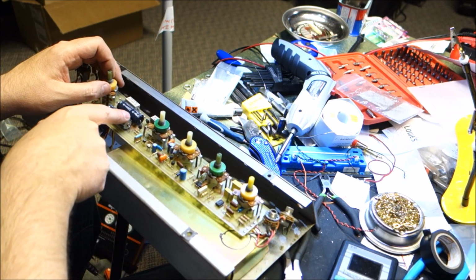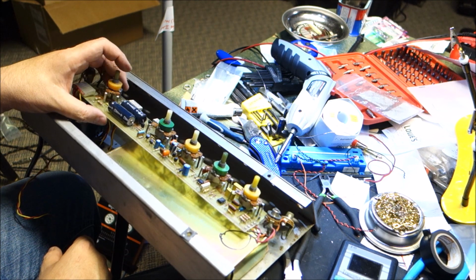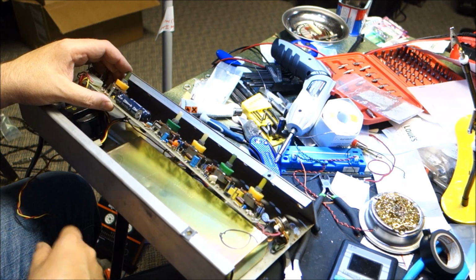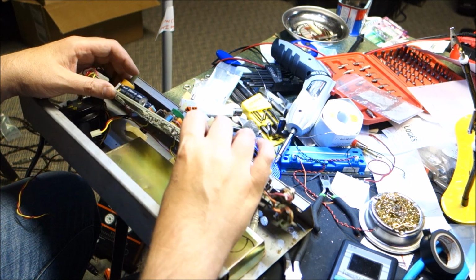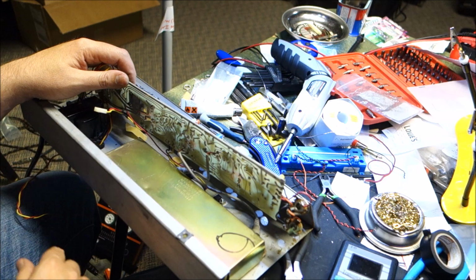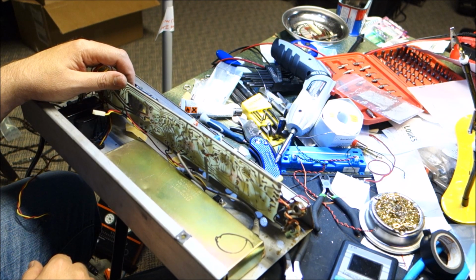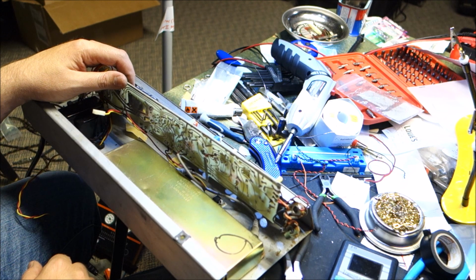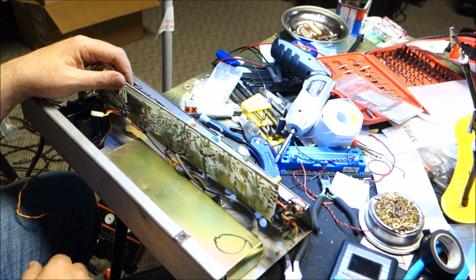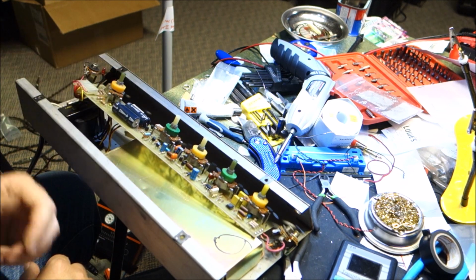And then our filter capacitors are axials. Although looking at the bottom of the board, plausibly we could put radials in it anyway. They seem to have cut it for either or. I kind of have more radials than axials, so I may just do that because it'll all fit the same.